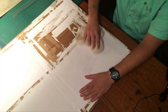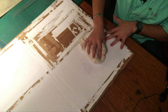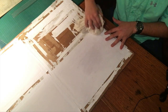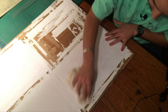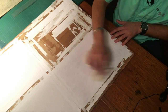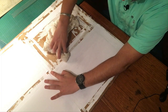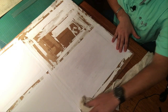We have a moist rag and we're going to start from the middle, working our way out. The rag is moist, so use a very conservative amount of pressure. You can somewhat see the pattern of the fabric as the paper gets wet, so do this very carefully and consistently — if the paper rips, you have to start over. Once you're confident the center has all the bubbles out, come back over the edge again with little pressure on all four corners and all four sides.